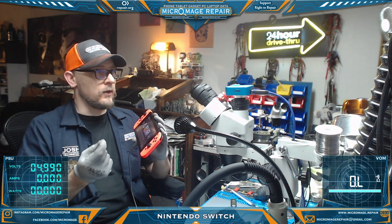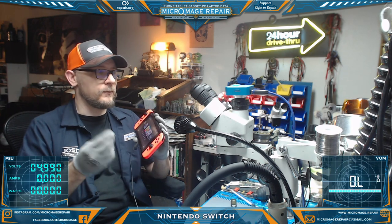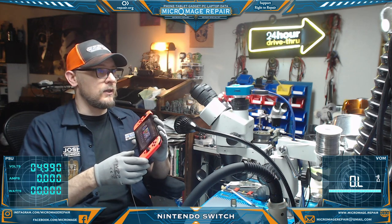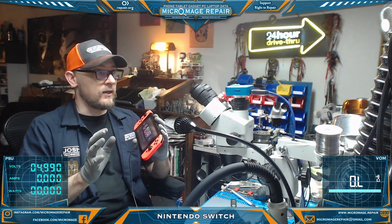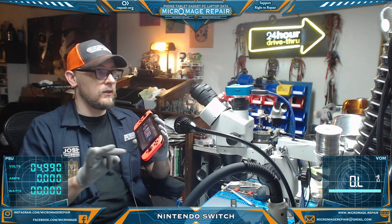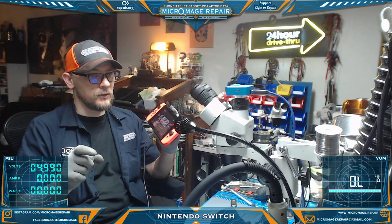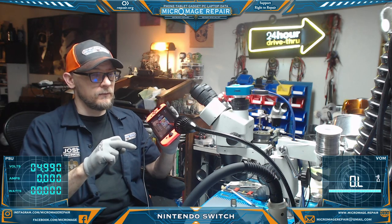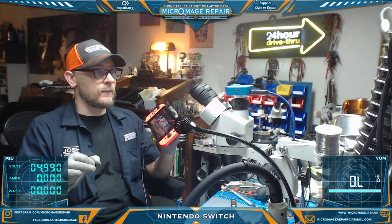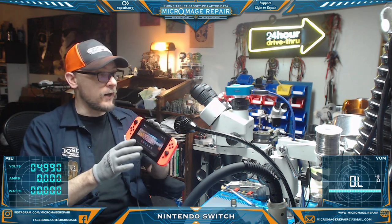It had corrosion on two of the vias, but one of the vias was still connected. So we just covered that in solder. Hopefully that will protect it enough where it won't become a problem in the future. But the other one was not connected. So we looked it up on a guide, figured out what test point on the connector was connected to that via through the ribbon. And we ran a jumper to that test point from the via and reestablished connection and reacquired touch.